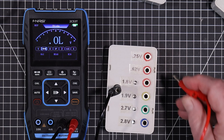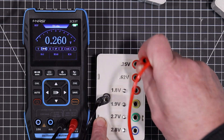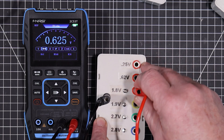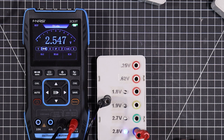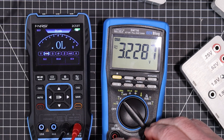All right, we've got it in diode check mode. 0.26 versus 0.25 — very good. 0.62. Now let's see what voltage it's putting out to test. 4 volts. That's a good voltage for testing diodes.